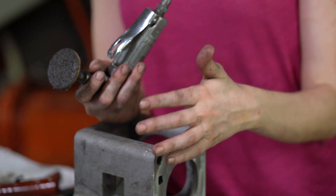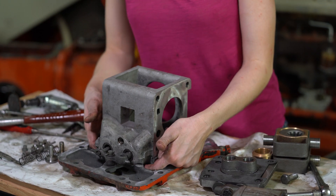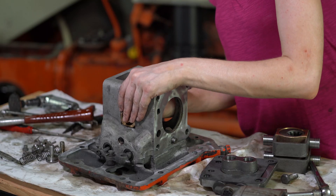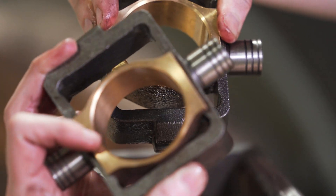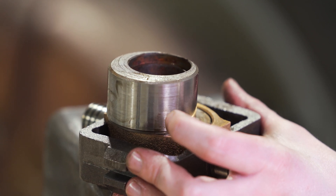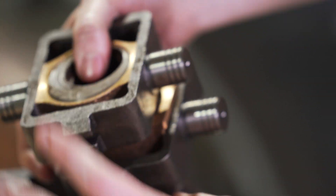Use an abrasive to clean up the remains of the old gasket. I put this in a parts washer and really got it clean - it was so sludged up at the bottom that no oil could flow through the intake. Make sure you thoroughly clean before starting reassembly. For reassembly, drop the new bushing in here. The cam block bushings slide right into the pistons with a little lube. When assembled together with the cam, you end up with both pistons having the oil delivery tangs down towards the bottom, with the two flanges facing each other, then drop it down into the pump.